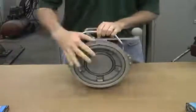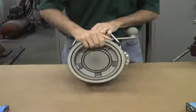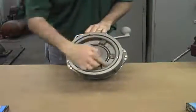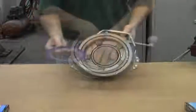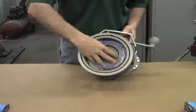The first step is to open the coupler by moving the sleeve forward. With the D4 you have five interlocks on the face of the coupler. All five need to be defeated at the same time for the sleeve to move forward. This can be done with your hands or you can use a large washer or gasket and press it in.